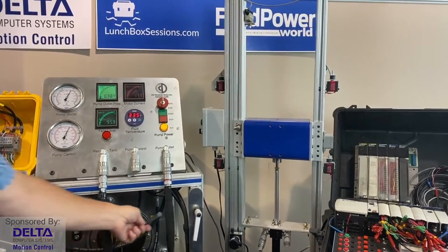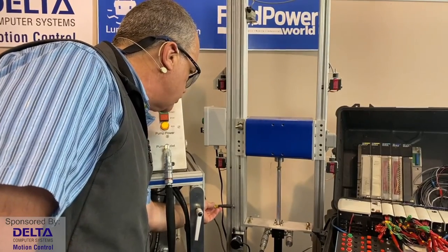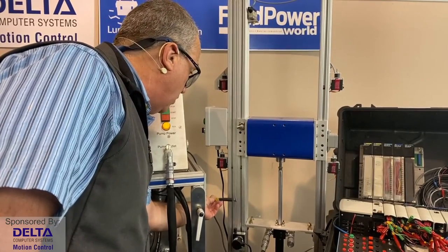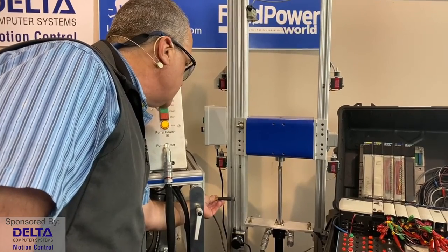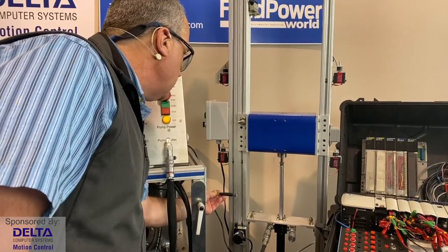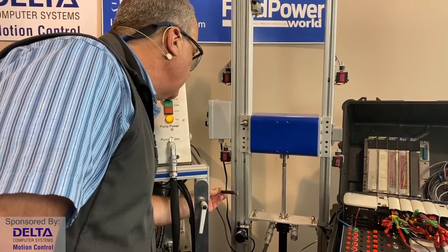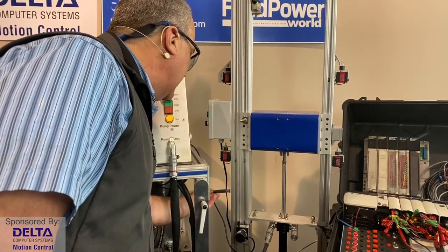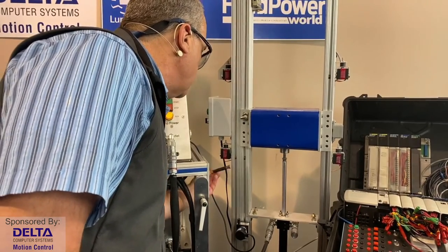And by the way, this is a good time for us to talk about something in control theory called disturbance. So I'm just going to put my screwdriver behind the wire to keep myself safe here, and I'll pull outward on the cable. And when I pull outward on the cable, that tricks the control system into thinking that maybe something pulled the cylinder rod out, right? And so what you'll see is that the control hydraulics is pulling down on the cylinder, thinking that it drifted outward past where it was supposed to be, right? When I let go, it shortens up, and it figures the cylinder came back in, so the control system extended.